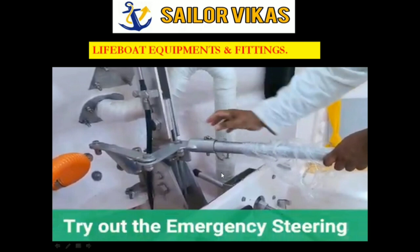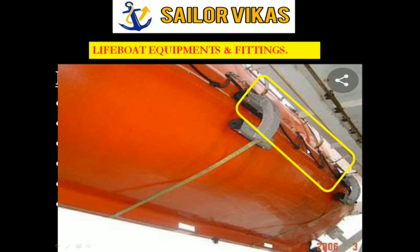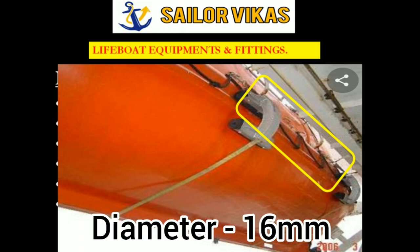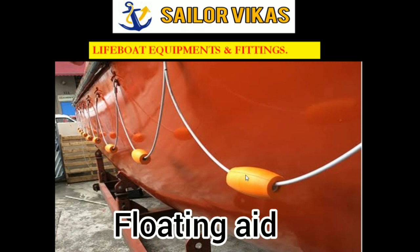So other than this, we have becketed ropes or lifelines. So we have to inspect this also. As you can see here, these black color ropes. There is a requirement that these ropes should be 16 mm and they should be buoyant lines. So either they will be black color or they will be similar to this and they will have a floating aid on it. So these are the becketed lines.